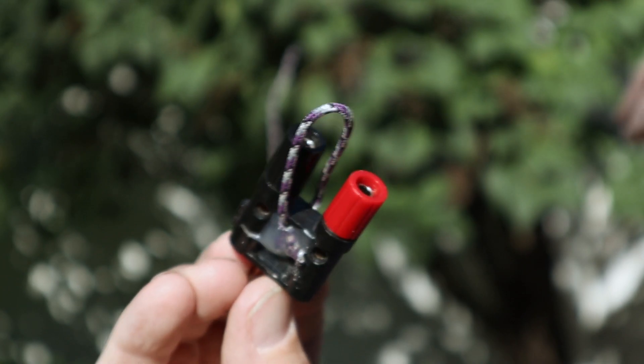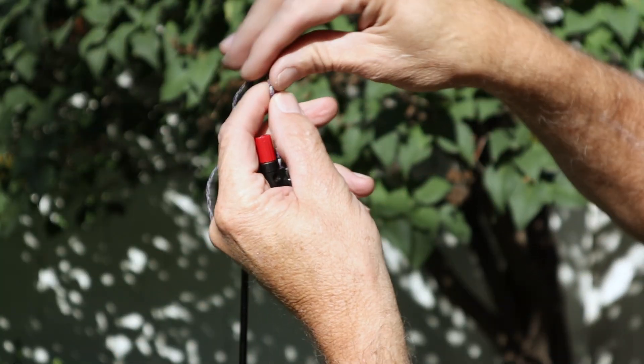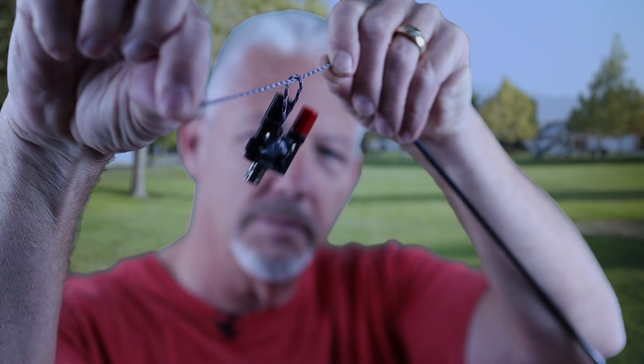I'm a pretty big fan of paracord — it's got a lot of uses. You can tie a knot in it and take it back out and reuse it for something else. On the center insulator I'm also using paracord, and that's the part I use to tie everything together. Taking the rod when I'm out in the field, with it maybe only four feet off the ground, I just shove the center insulator through it. Tie a simple knot, and that's going nowhere. When I'm done with a SOTA activation or a park activation, all you have to do is give it a quick tug and you're done. It's just that easy — a super simple thing to do that makes deploying your antenna mast that much easier.